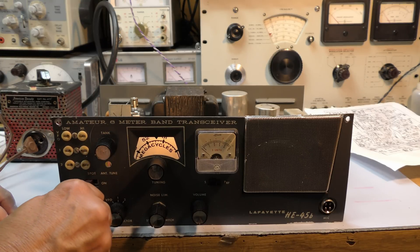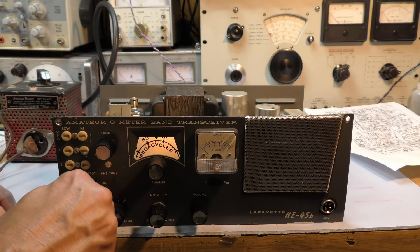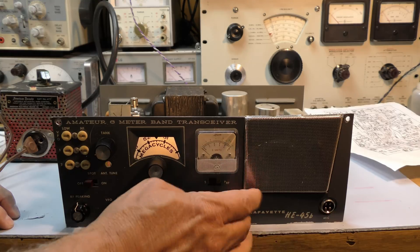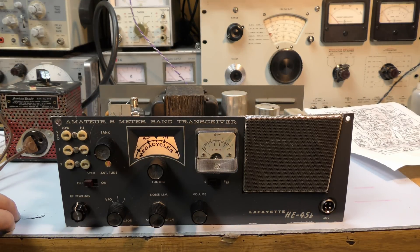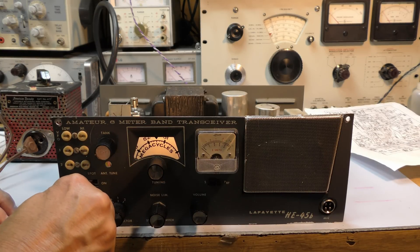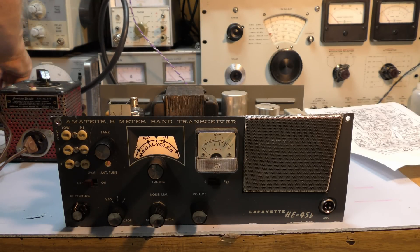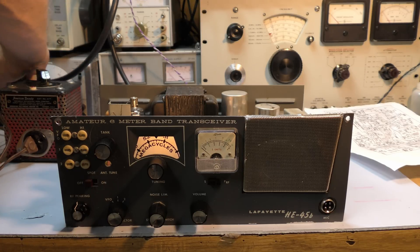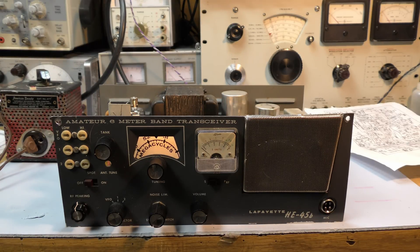Let's try peeking. We just lost something. A little more work is needed — maybe the relay contacts need a little more cleaning. Now I'm going to remove the antenna. That tells me that tip to tail, the receiver is basically working. That's a really good sign.